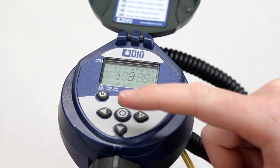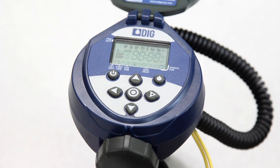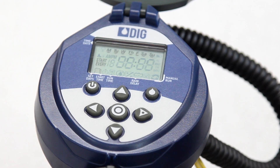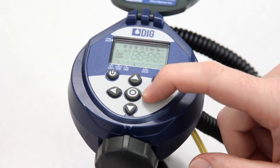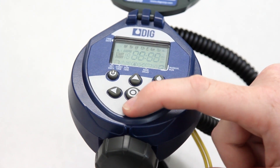When this is finished, press the center target button again and move on to the set days mode. To program the RBC timers to water on specific days of the week, push the target button until the set days icon appears in the lower left corner of the display. Along the top of the display, the watering days will be underlined. A new timer will have every day set up as a watering day. To make a non-watering day, simply push the right arrow button until the day flashes, then push the down arrow and remove the underline. Repeat the steps to remove or add underlines and finish setting up the watering days. The timer will only water on the days with an underline. This timer can also be set to water on a cyclical basis, which we will cover later on in this video.